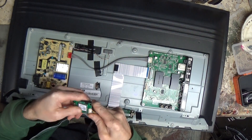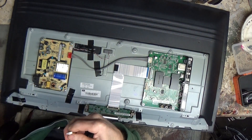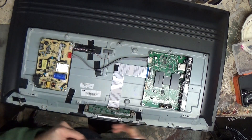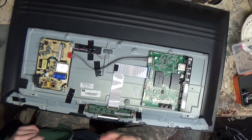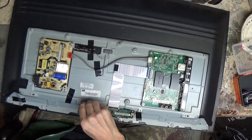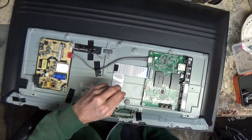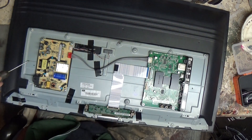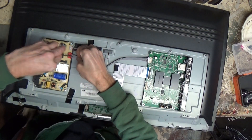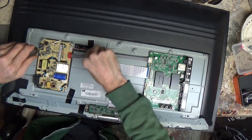That's actually a trick to get to some boards — maybe schematics — by looking up the FCC ID or patent number. If you can find something that's patented and posted, it can help with schematics. I haven't had much luck with it, but I hear that is a way to do it.